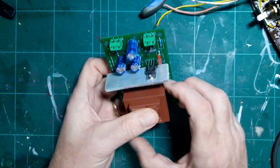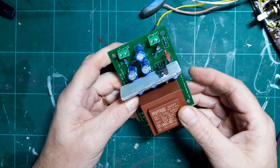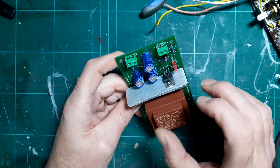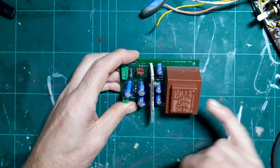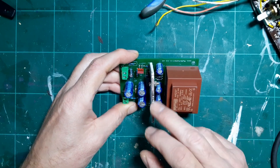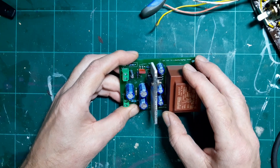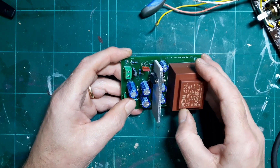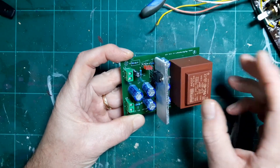This is the battery eliminator I bought — these are off eBay in the UK, manufactured by a gentleman there. They have a 90 volt high tension supply and a 1.4 volt low tension supply for the heaters. It's quite simple to make actually — these are just an encapsulated transformer, 240 volts in with 12 volts out, and then a step-up DC to DC converter, because the high tension anodes of the valves don't take a lot of current.